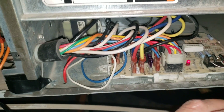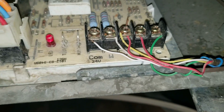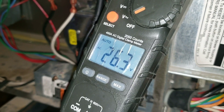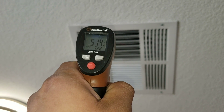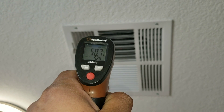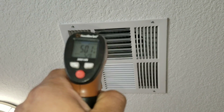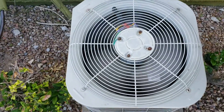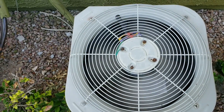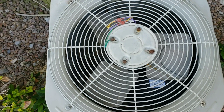What's interesting is when I move my multimeter lead to my condensing unit's Y terminal on the board, I'm getting a reading of 26 volts. I'm also checking the temperature out of my duct and it's coming out pretty cold — colder than the ambient temperature in the unit. If just the fan was running, I'd have a temperature similar to what the thermostat reads. Sure enough, I'm here at the condensing unit and it is running even though my thermostat is set to heat.